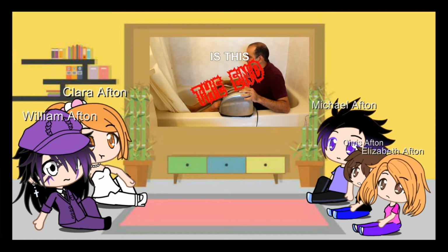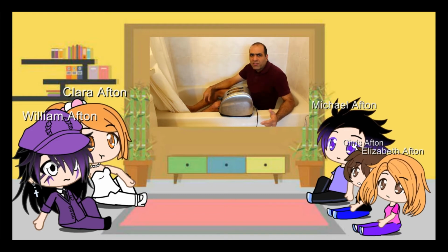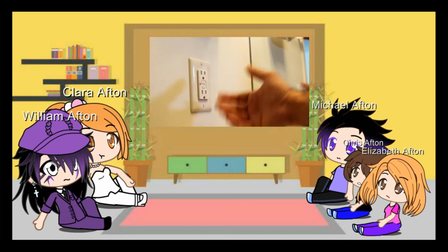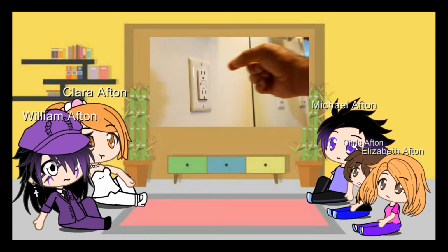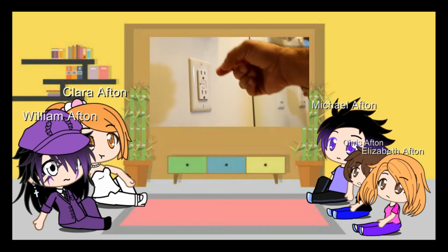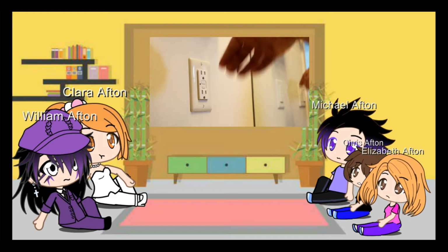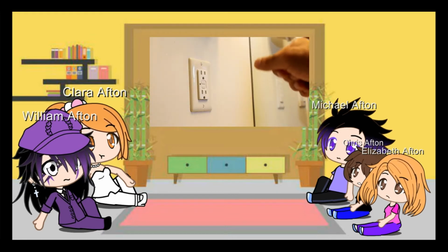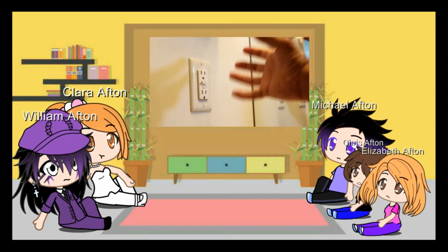Is this the end of the lovable idiot? Well, before I put myself at the mercy of technology, let's test it differently. What the GFCI outlet does is that it senses the current. Any current that comes out of the live wire must return to neutral to close the circuit. If it comes out of the live wire but doesn't return to neutral, it means that it's going to earth through an unwanted path. The outlet would open its breaker right away to avoid the unwanted current flow.